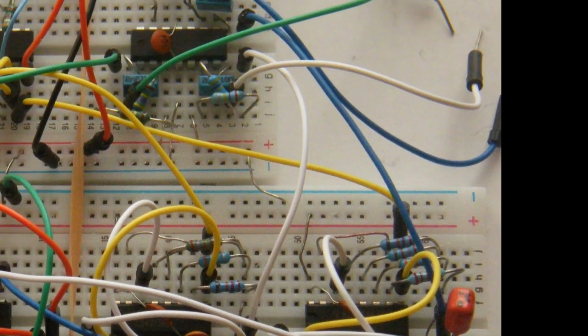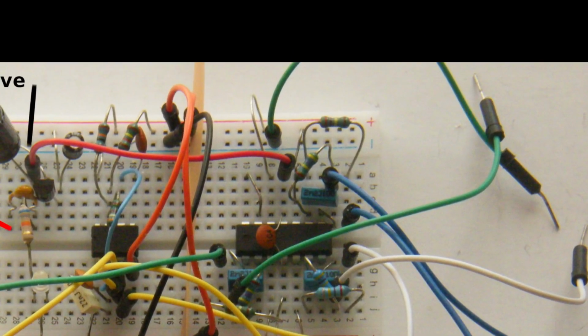Now, nestling in the top right hand corner is the LM324, configured as low pass filters and output stage. There is a spare unused op amp, which I always link the inverting input to the output and take the non-inverting input down to 0 volts.